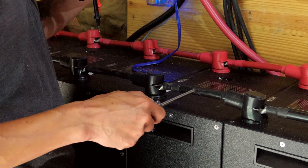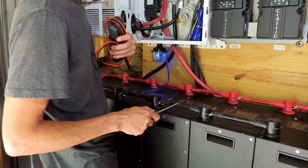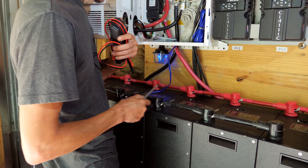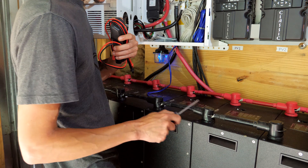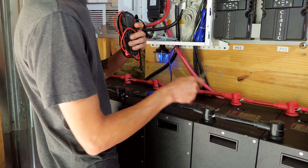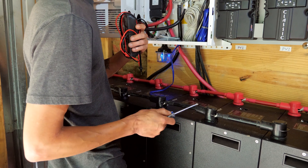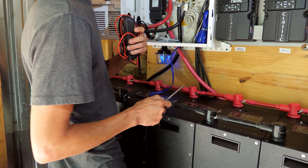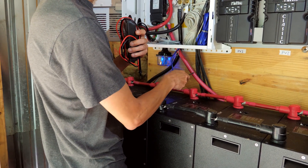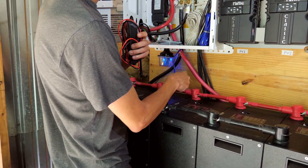All these battery cables are about 8.5 inches. When I got these, actually two or three of them weren't long enough — they were off by about a quarter inch — so I actually had to stretch these a little bit to get them all to fit. Because you want all your cables to be as short as possible, and they have to be exactly the same length so that your batteries charge and discharge evenly. These are 2-aught battery cables with 3/8-inch terminals, and then the positive and negative main battery leads that go to the power center are 4-aught cable, so we have no problem moving a lot of amperage through these cables.